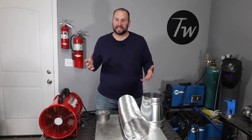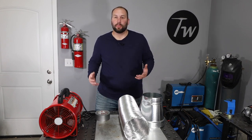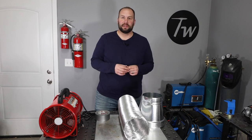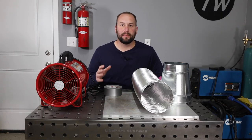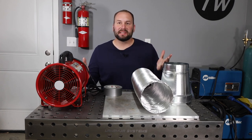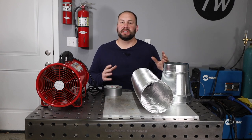Welcome to the shop. There are a lot of health and safety concerns when it comes to welding, and one of the most difficult to manage is welding fumes. Proper fume extraction units are very expensive and very large, and I've intended to put in ventilation in my garage for quite a while but haven't. So I open doors and try to get a breeze to blow through when I'm welding, especially with flux processes like stick or flux core, and even with gas-shielded processes like MIG or TIG you can get some pretty nasty stuff in the air, especially when welding aluminum or stainless steel. Wearing a respirator is not a bad idea — once you get used to them they're not too bad.